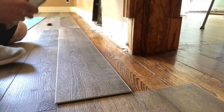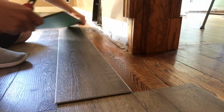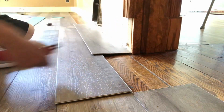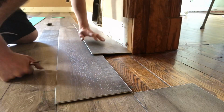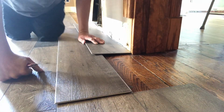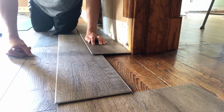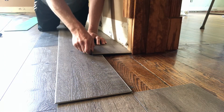We're going to take another plank and check this out right here. This is a quick hack trick. You're going to take the same size plank and line it up directly with the wall, mimicking what needs to be cut out. This is going to become our template piece. So everything's lined up nice and tight, and in theory, most times it cuts out just beautifully.